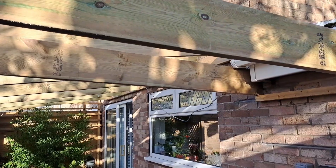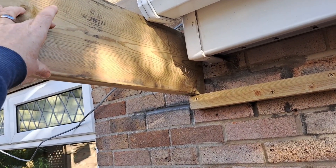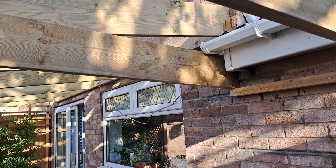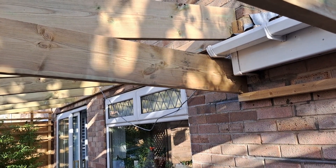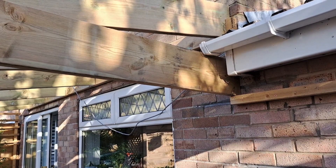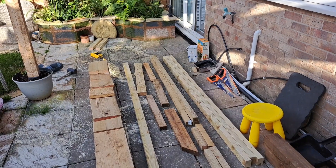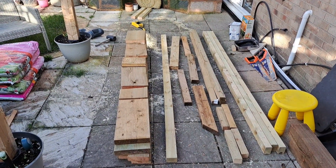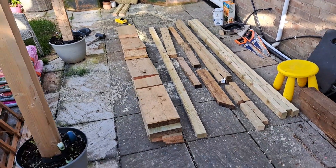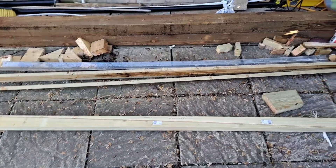When it comes to the roof, originally when I was conceptualizing this I thought I was only going to use half the size of this wood, meaning I'd need another gutter on top. But as you can see it's since changed because I've used wood that's twice the thickness — it still hasn't quite reached the top of the gutter. So I need something to take it up. That gap where the gutter is is seven centimeters, so I've bought some wood that is seven by two. The plan is to slice that diagonally lengthways — and here's one I did earlier last night. I've actually done two of them, cut straight down the middle lengthways.